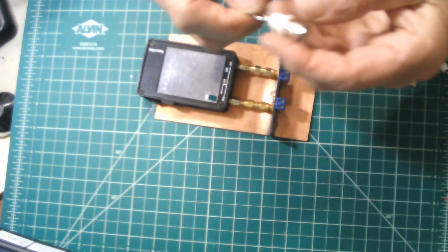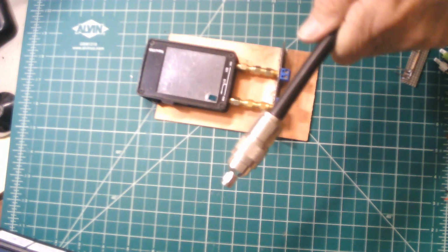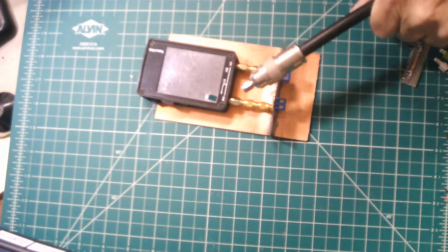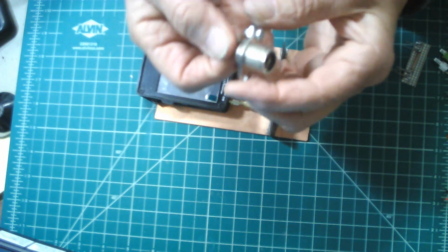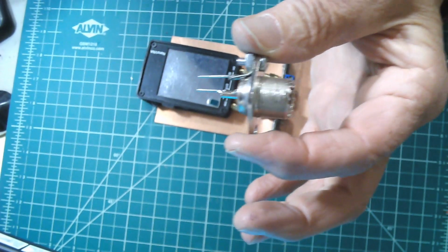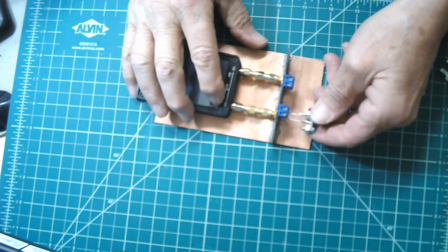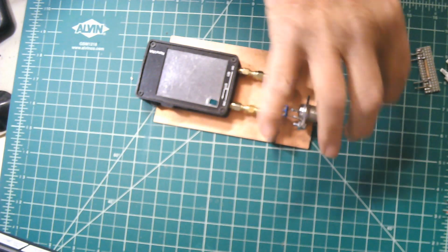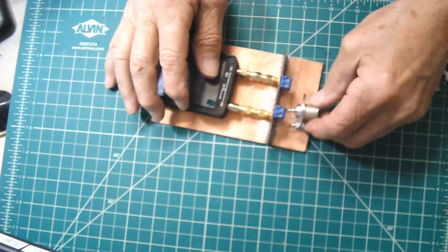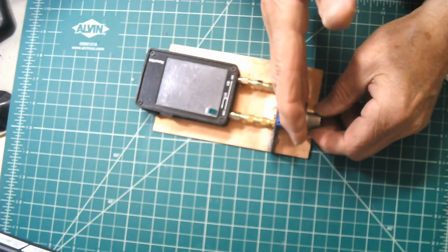Or if you've got a BNC connector, or for instance with our big fat coax here, instead of plugging it in there and breaking the SMA connector, you put it on this guy. I just made that and put this in the junk box with the connector. It just goes with it, and then that plugs on here. Screw it down, and now you can put your big connector on there. You could stabilize that more if you're so inclined, but this will hold that thing.